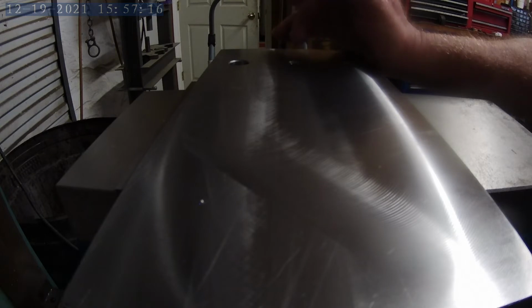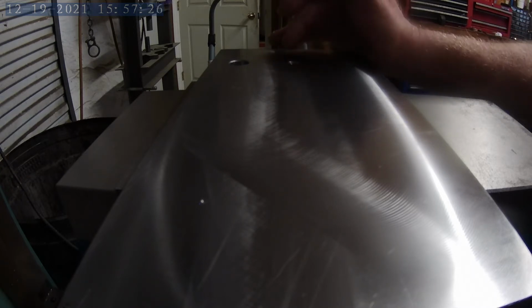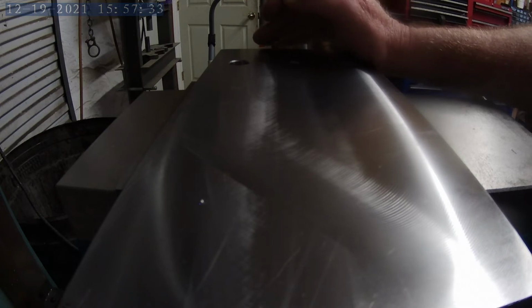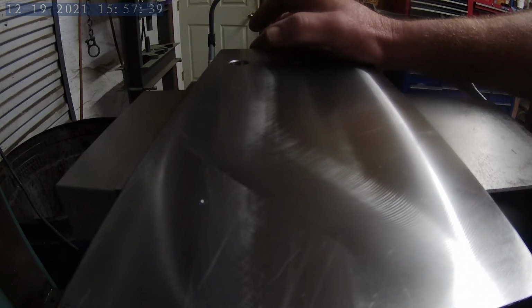Apparently, whenever I went to drill the hole for the 3/8 16 tap, I picked up the wrong drill bit. It was undersized, which caused the tap to bind and break, and while I was off camera, I kind of calmed down a little bit, re-drilled the hole, ran a new tap through it, and so that part's behind me. So I'll go ahead and drill and tap these holes, put it together, and I'll call this project tonight, and I'll pick up on it later.